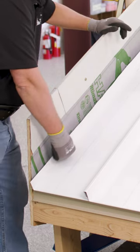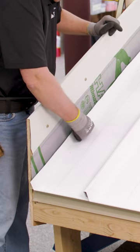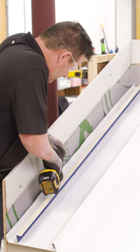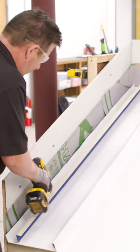When we install the panels, the panels also need to be field bent 90 degrees. After that, the Z-closure is installed over 3/16 by 7/8 inch butyl tape and attached at 4 inches on center.